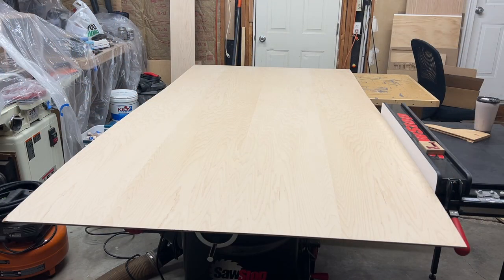Because my tall cabinets are actually two pieces, I need to cover the side of the storage cabinet and one side of the pantry cabinet where it'll be exposed, so you won't see that gap or the pre-finished birch plywood. I'm going to do that using this quarter-inch maple plywood. I'll cut this down into two pieces, get some stain on it, get it clear-coated, and then do the final scribing to the wall and fitting once we start installing the cabinets.